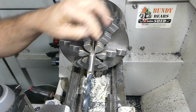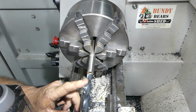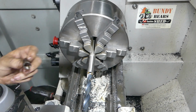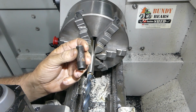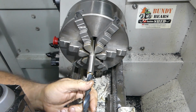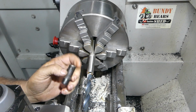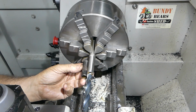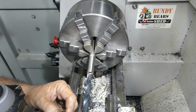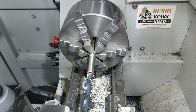Okay, I've got the half inch drill. Now, this isn't a particularly good brand half inch drill. It's a cheaper one I had, but not a bad edge on it. Now, I tried a 13mm drill up the tube and it was oversized, it wouldn't fit, yet a half inch one fitted. So I'm going to put the half inch one up and presume it's going to run out a little. Now it's only going to have room for a 7/16 head stud to go through it, so the finish isn't important, and if we're a little bit over or undersized, it's not important either. So we'll just see how we go and see what we can come up with.